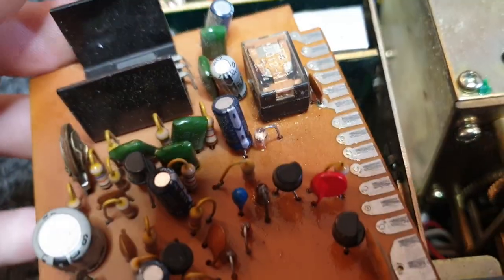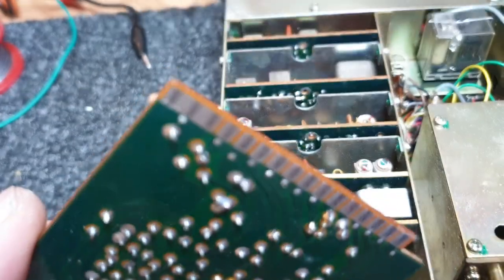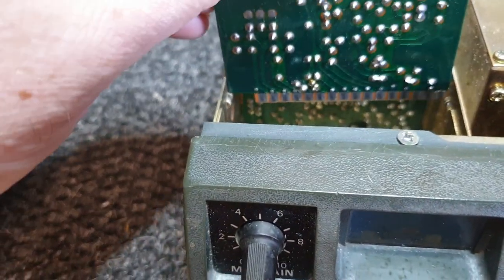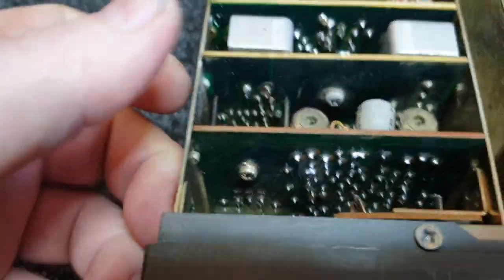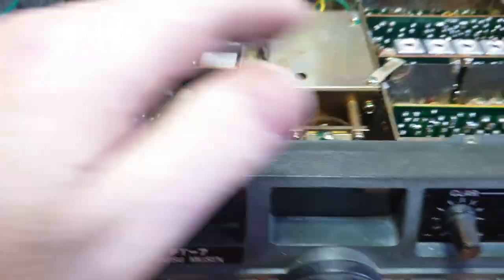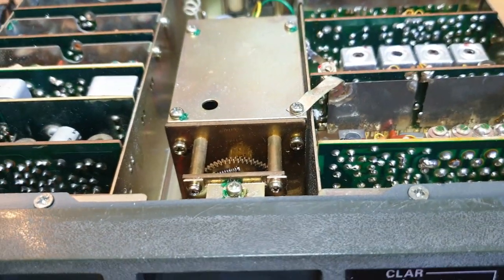Be very careful with these contacts though. A lot of people think you can solder them, but the best you can do is clean them and give them a very light sandpaper. That seems to get away with it, but you definitely don't want to go playing with the contacts too much down the bottom - just clean them out. The usual story: get Deoxit D5 over everything that you can, but very, very lightly on all these boards. They have a few issues that can come your way.